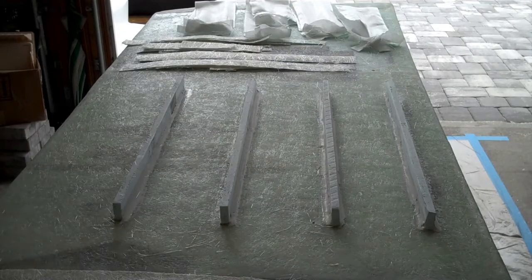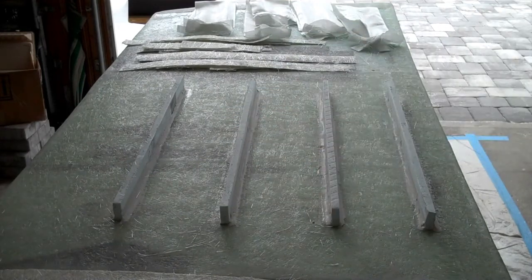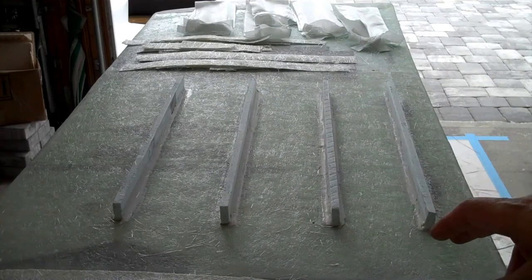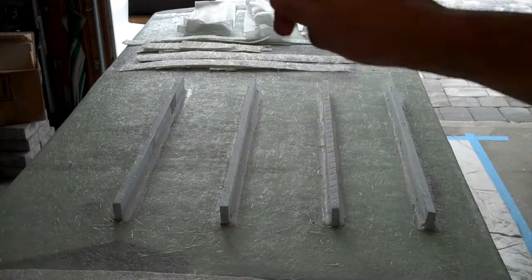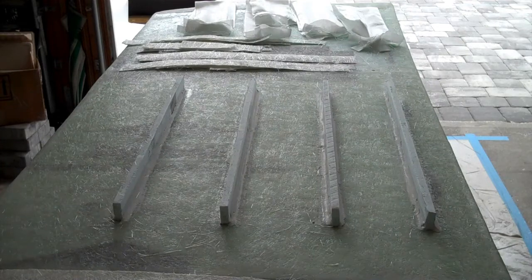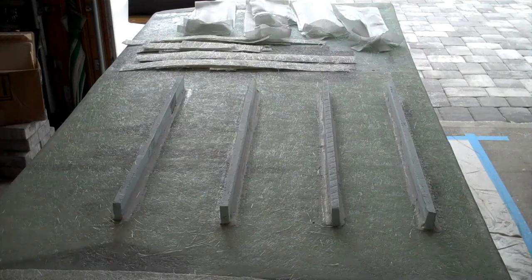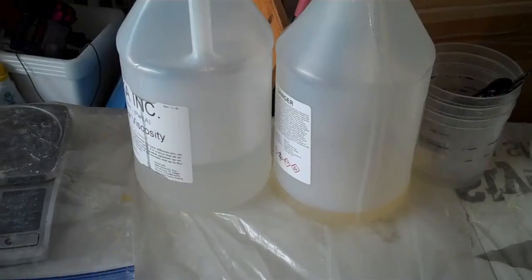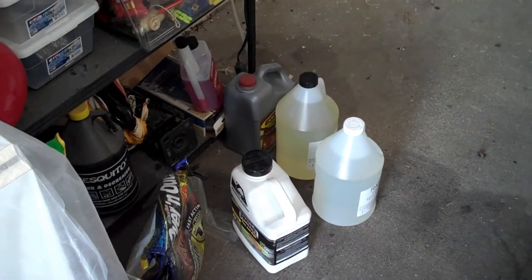I'm going to mix a medium-sized batch of resin to do the four woven fiberglass cloths. I'm just going to dump resin in between these spars and these three wells here, and then I can just set things in there and wet it out and then use it. I'll be dropping chop strand mat and the fiberglass cloth into these wells and hit them with a brush, basically wetting them out completely, and anything that drops back down will drop into those wells. I'm going to be using this fiberglass part as a place to soak my stuff, and just put extra resin down the whole middle there as well. Alright, resin and hardener combined, I have maybe half a gallon to work with, but I have extras if I need it.